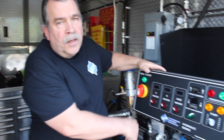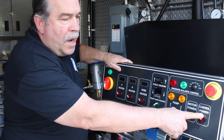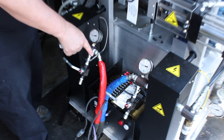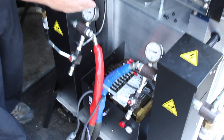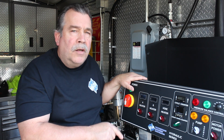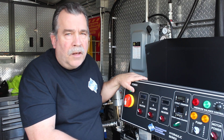I'm going to show you what happens when you turn on your machine. You turn on your main power, then your control power. Once you turn on that control power switch, the red light on the bottom of the hose transformer box should turn on — that means you're getting primary voltage to power up the hose transformer. If that red light does not come on, 99% of the time the inrush current limiter is bad. Make sure that red light comes on.